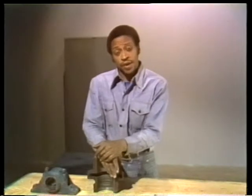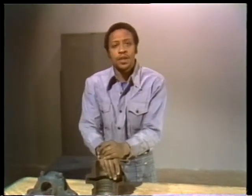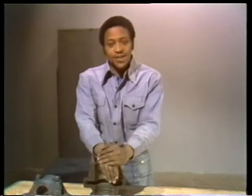We've covered three problems that can produce bearing failure: metal fatigue, misalignment, and improper lubrication. You should understand why each of these is a problem and how it happens. Let's take a few minutes now to review the material we've covered in this program. First, we discussed how a sliding surface bearing works and the materials used to make it — remember that babbitt is the material most often used. Then we looked at three kinds of journal bearings and three kinds of thrust bearings. Finally, we talked about how sliding surface bearings are lubricated, the three major indications of bearing performance, and the importance of developing the skills you need to diagnose what's happening with a bearing.